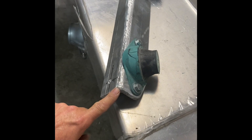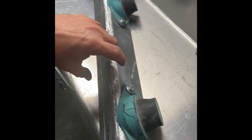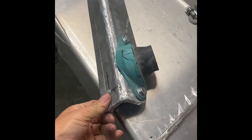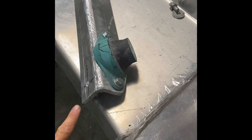It's an outside corner edge to edge. What you do is put the tacks on the ends, and that allows you to adjust the angle that this thing is sitting at. I put this on the motor, dropped it in there, and if the motor mount to the engine bearer is not perfectly 90 degrees, you still have the option to fit that. So it's mounted to the motor, then I clamp this to that engine bearer.